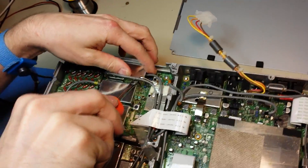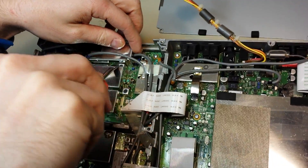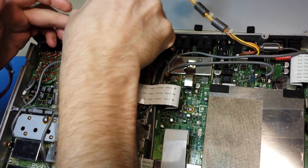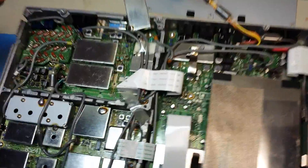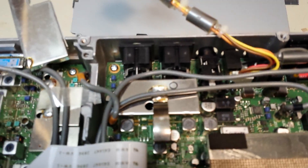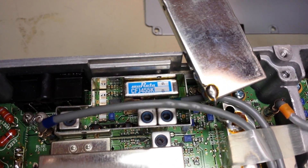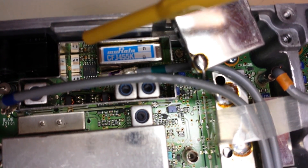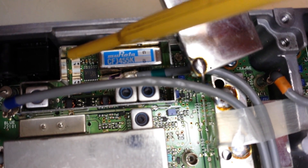I'm going to lightly pry up this can — it's kind of a ground jumper. Let me get the camera to focus; there's some light around here. There's that third filter right there, and according to VK2DAG Matt's instructions, you connect the shield of your small coax to the shield of this filter.